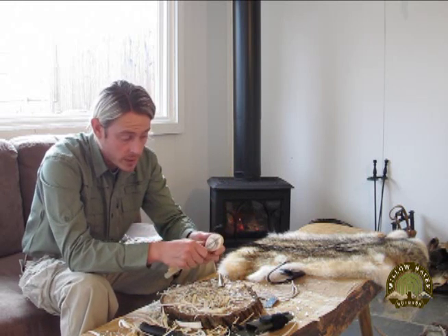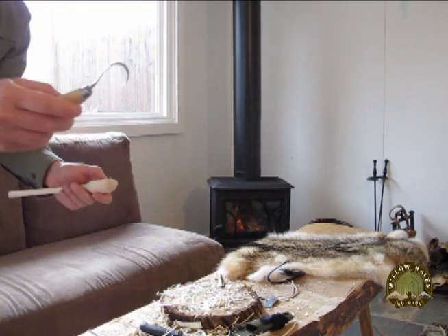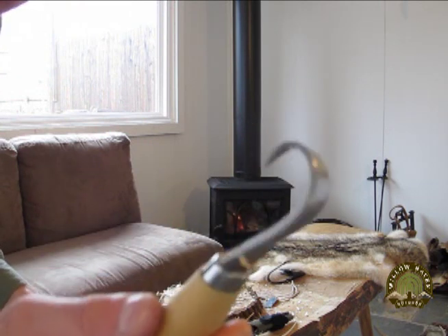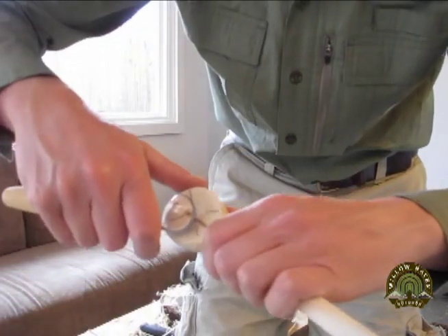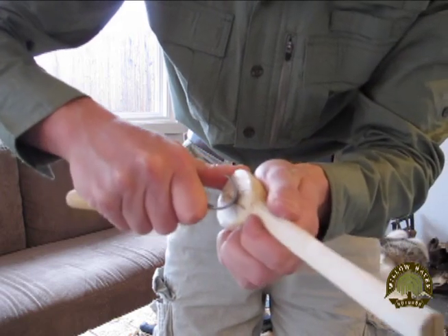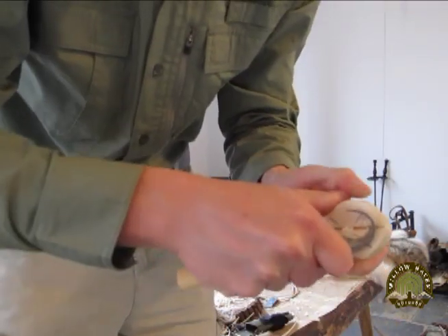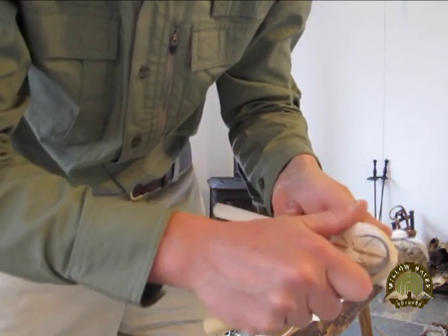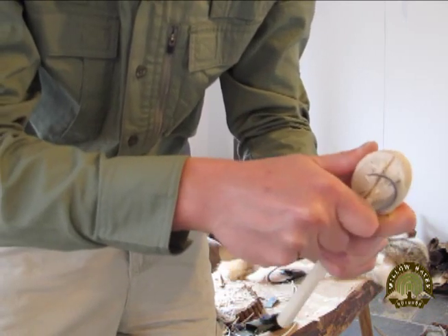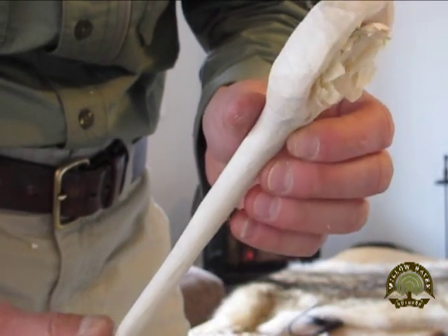I'm not going to do that today — I'm going to use my hook knife, which is basically a Mora knife bent into the shape of a hook. If you've never seen one, they're just like all Moras: not that expensive, probably only 18 to 20 dollars or so. If you get into spoon carving, it's a worthy investment. I'm going to go through the whole bowl with the hook knife, doing nice slow carves and digging out the bowl. You can see how well this hook knife gouges out the inside of the spoon.